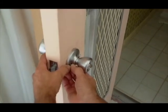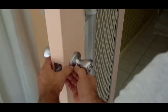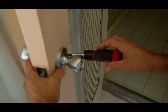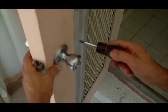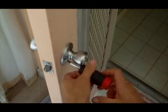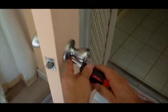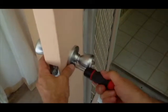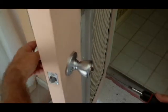So it's a little hit and miss — as you can see, it can be a little tight. Now we just tighten those up once we've had them started into their pilot holes. I'll use my foot to hold the door so I can use both hands. The toe of my foot will hold the door in place and I'll tighten the screw all the way down. I'm not over-tightening it because we don't want to strip it out.